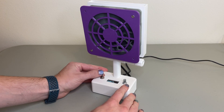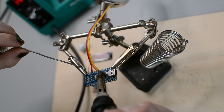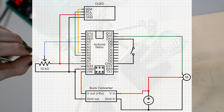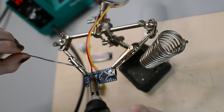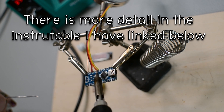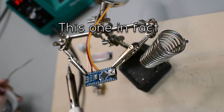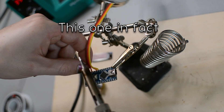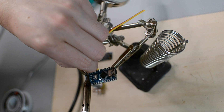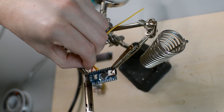Here's what I built — take a good look, because now we have to assemble it. I'm going to skip over the soldering of the circuit, because that's boring to watch. Just use this circuit diagram to wire it all up. You can directly wire almost every component, except you'll run out of ground pins — I used a piece of protoboard connected to VIN and the ground pin for that. One complication: I ended up burning out one Nano. The voltage regulators on these clones, while rated up to 12V, really don't want to be there. I ended up adding a buck converter to drop the voltage down to around 5V for the Nano, and added the fan power wires to the 12V incoming supply from the barrel jack.